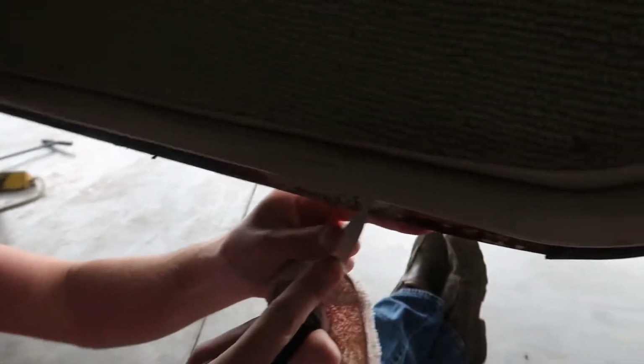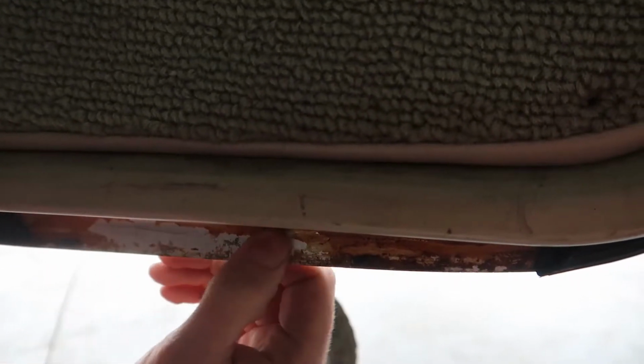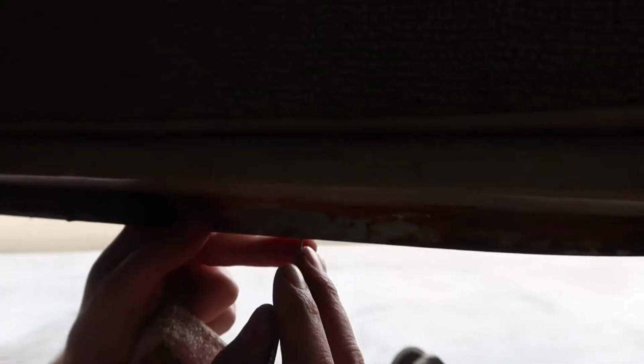But we'll treat this before we add any 1300L back to it. I'll clean it up real good and treat it with some iodine and keep it from corroding anymore. There's just ever so slightly, I mean the tiniest bit of corrosion right there, pitting from corrosion. A little dark spot right there. So we'll go around and clean this dark spot up. We'll make it like new when we're done. It still softens up. I guarantee you this has been here since '77. Only really seen about one layer of glue. Pretty consistent.